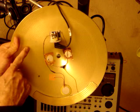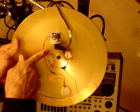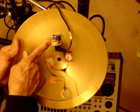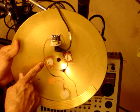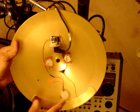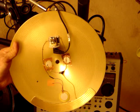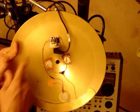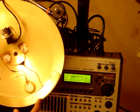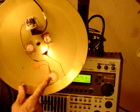The bell triggers are taped to the bell, making an electrical connection. From there it goes through the cymbal and up to the ring. These go to the shield, and these leads here go to the ring. My choke goes through here — it's on the same ring circuit, so I tied it in with the piezos. All the common stuff goes to the shield or the sleeve of the TRS jack. This gives me one zone on the bow, one zone on the bell, and a choke.